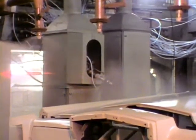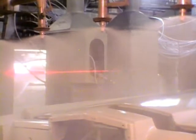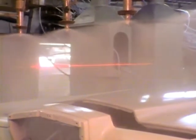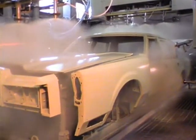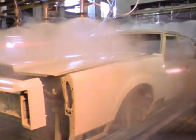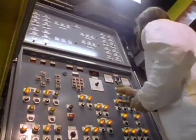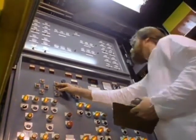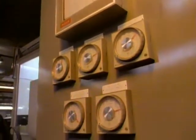This is an electrostatic spray process with the body having an electrical charge on it and the paint particles receiving an opposite charge as they leave the gun. This causes the paint spray to be pulled against the body evenly around curves and bends and inside all the openings. Each spray head and paint delivery line is monitored by its own separate pressure gauge that allows the operator to check the system constantly. The atmosphere in the booth is fully temperature and humidity controlled to ensure the best spraying conditions and that no dirt or foreign material gets into the paint to spoil the finish.